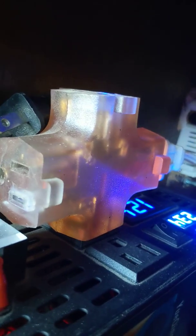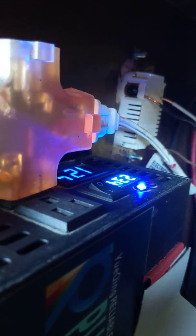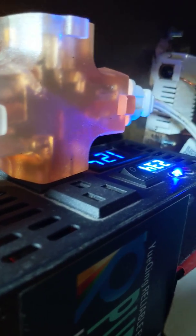I plug this triple thing in so that I can use little tiny things, like that plug that's not plugged in, which is my power tool battery charger. It's not plugged in because it literally has a red light that stays on. That's like a phantom load that I don't need. That cord back there is simply a lamp, just a tiny little 9-watt lamp. And it's also got my cell phone charger on that that's wrapped around underneath my bed so that I can charge it on my nightstand. But tiny little things like phone chargers, tablet chargers, camera chargers, those are fine, but you don't need to overload this because you've got the hardwire terminals.